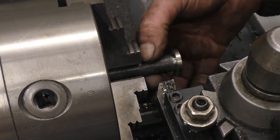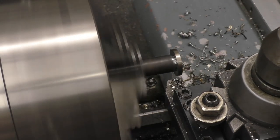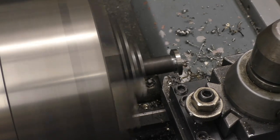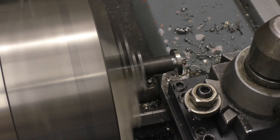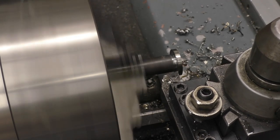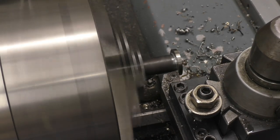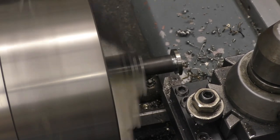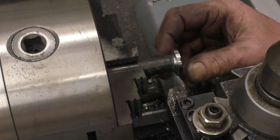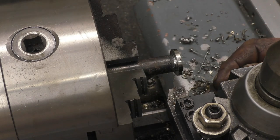I've decided to leave this part of the valve, the spindle, that'll seal all right with the packing. But what I have done is I've built the valve up with 309 stainless, just so I can cut a new seat on it. It's all about a decent metal now, nice and thick. There was hardly anything left of the original valve head.